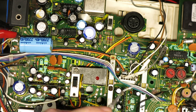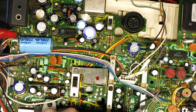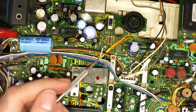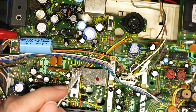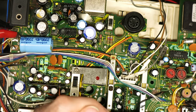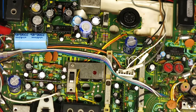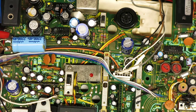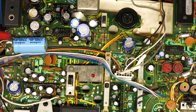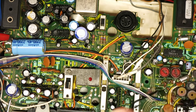I nearly removed one of the chips and all sorts — I'm glad I've sorted it. Sometimes these things just take so much hunting to figure out where the signal has got lost. There are also I think a couple of component number misprints — C502 and R502 appear twice — which really doesn't help. Anyway, if I just prop this up with some radio interference on and put on the power, turn the left channel on — it works. Turn the right channel on — it works just the same. Both channels are now properly working.